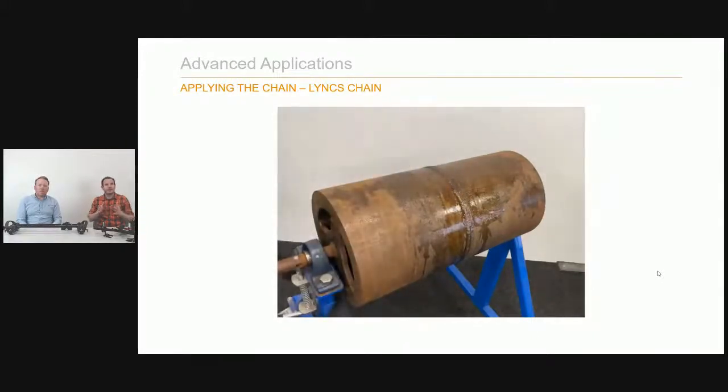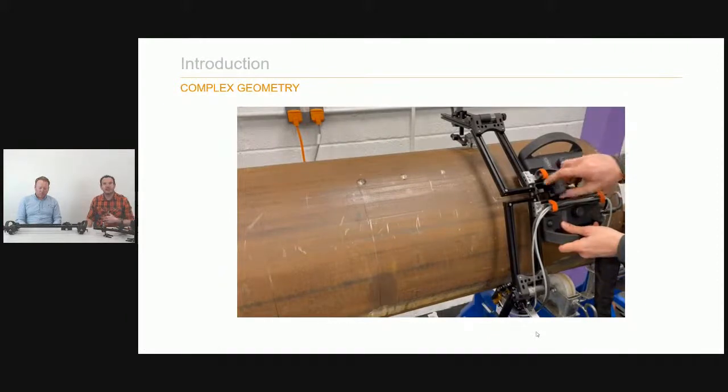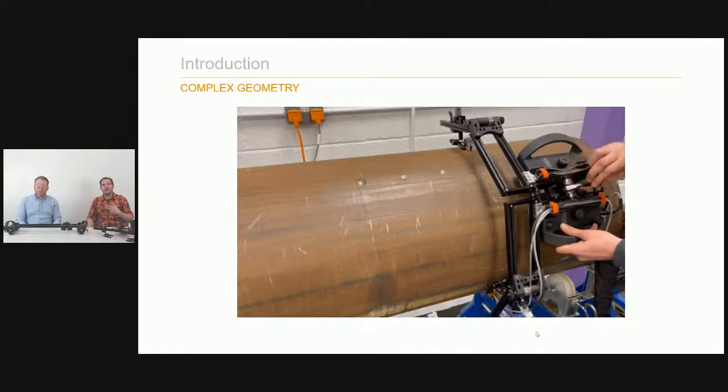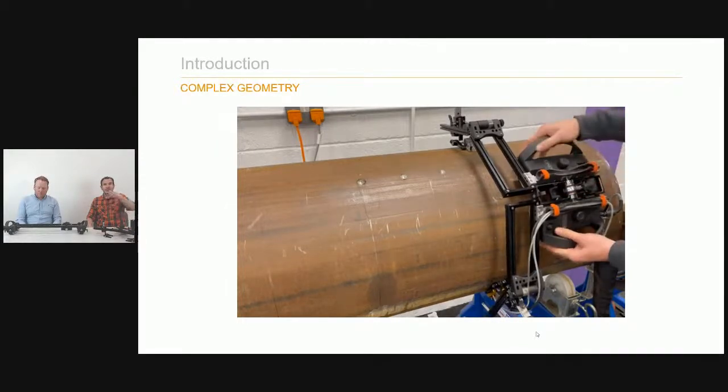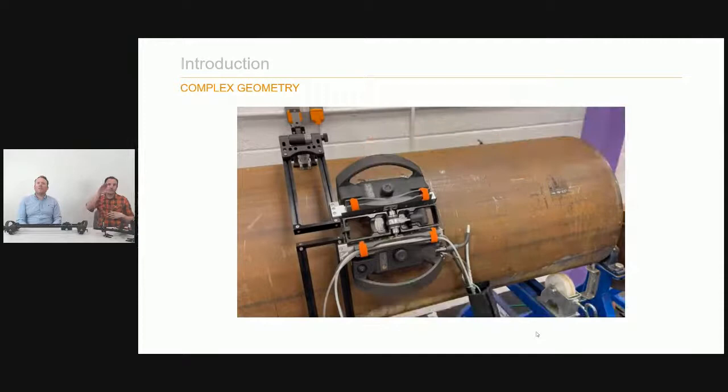This next video shows a complex geometry inspection, or inspecting for CUPS where we had some corrosion scabs. We actuate the ratchet to adjust the range of the tractors. At the top you can see a hinge bracket — we've extended the rails and added an extra set, so you could have two phased array probes either side performing phased array pitch-catch. You could also look at M-SKIP or short-range UT for such applications.